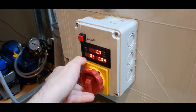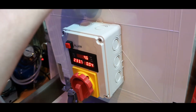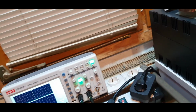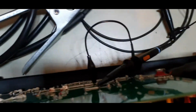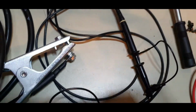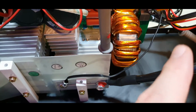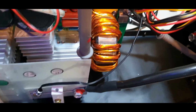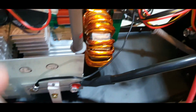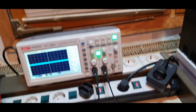We're back here. We're going to increase the voltage to 230 roughly, and I'm going to turn it on, and we are going to probe here across the primary transformer. We're going to see the waveform on the primary transformer, and the output voltage we measure here on the output of the rectifier on the circuit board basically, because it's easier than clipping there, because that's a big screw there. My clamp cannot fit that big connector, or screw. So let's turn it on and see the waveform.